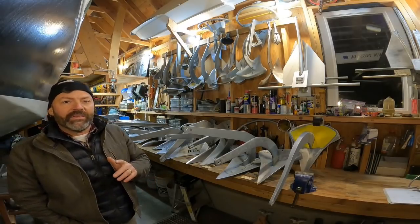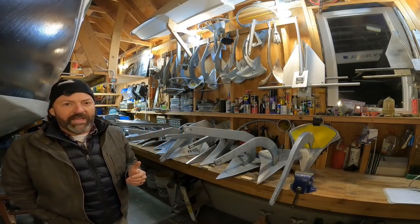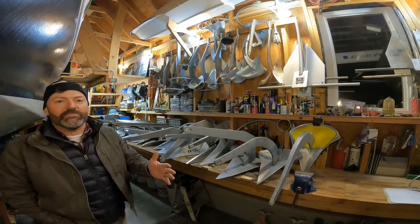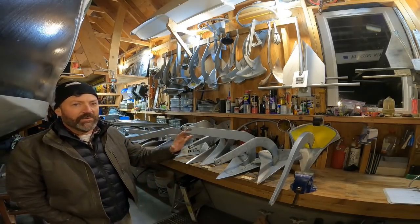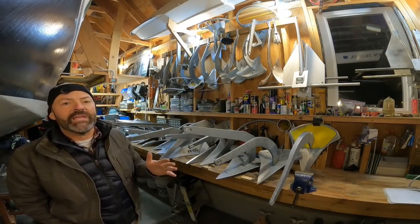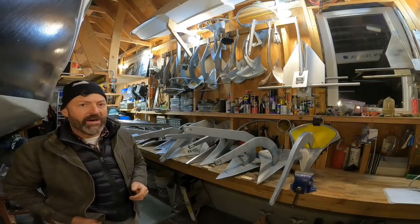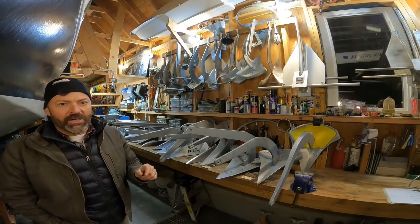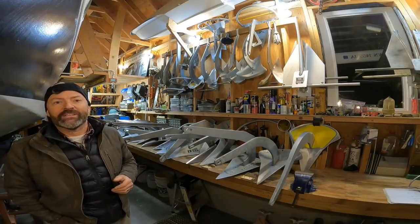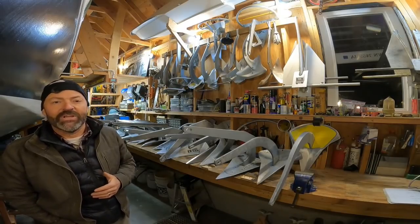The way boats ride to an anchor in wind with waves is not steady — you don't have a steady pull, it's a jerking rhythmic motion. These peaks are really all I'm considering when I measure this stuff and correlate it to wind speed. That would be the peak number that coincides with the boat surging, maybe a wave hitting the bow. Those peaks don't last very long — maybe minutes or hours as a frontal passage moves by.